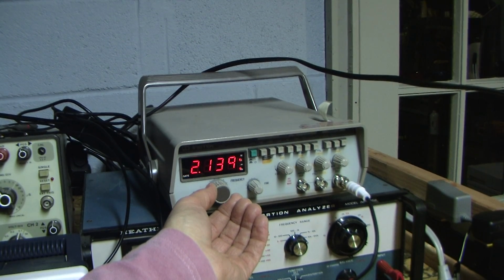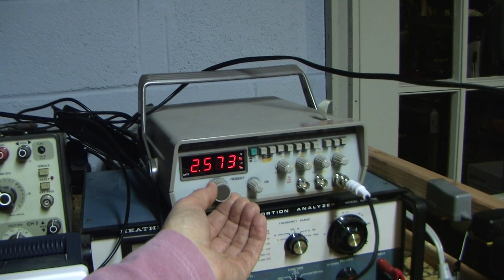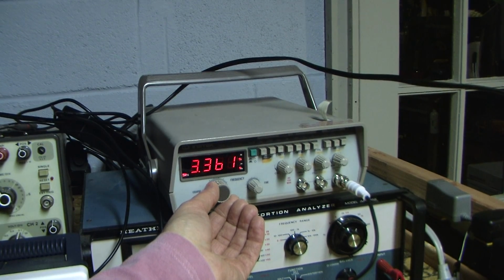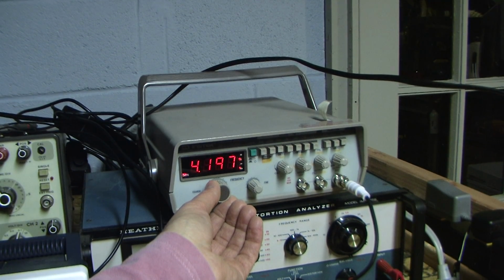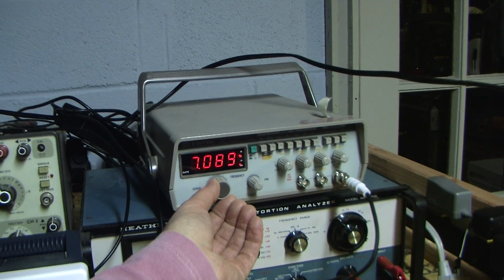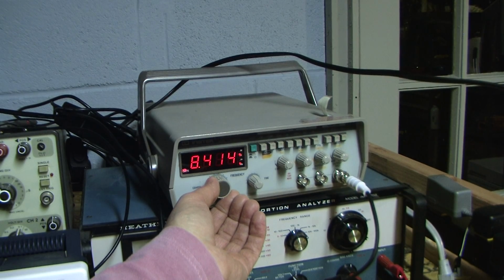There's an increase in level right there. Whoa, that's so the woofer naturally gets louder. Okay, now we're back at 3 kilohertz. We're back to about the level where it was at 1K. Okay, now it's getting quieter, right? It's really starting to get quiet right there. You can see it's rolling off. And between 8 and 10, there's nothing left.